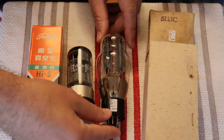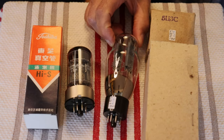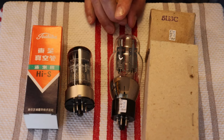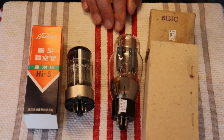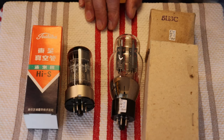Yeah, now we have to put one note of caution. Even though this is electrically identical to the 5U4G, that's the North American tube, there are some modern Chinese amps in which they haven't built their power supplies properly, and some of the vintage 5U4s will arc on startup. Yeah, not just these guys, but other 5U4s as well. Yeah, and it's a problem that we see with a lot of modern amps, that even though they use a traditional vintage tube, they actually don't test them with the vintage tubes. They test them with modern production. And a lot of modern production tubes are off spec. And the Chinese have a habit of making over-specced versions. And then, of course, they test their equipment on them, and consumers who want to put better quality tubes in get a shock when their tubes arc.